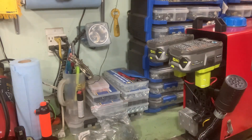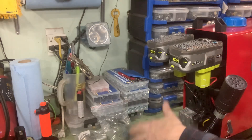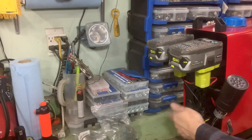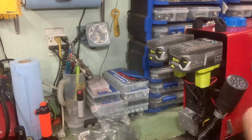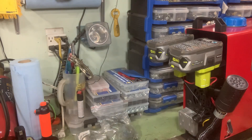Just going to clean up the wiring — this is more just to make sure it works. The intake is right here and I'm not blocking it at all, there's plenty of air getting through. This is the combustion intake, and that's the intake for the heater that blows into the air being heated. The combustion air never mixes with your heating air. The exhaust is over here — I'll turn this and show you.